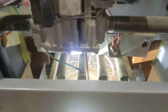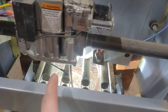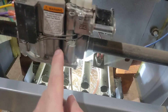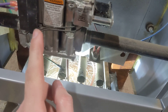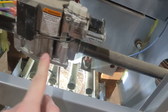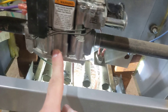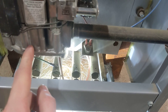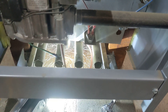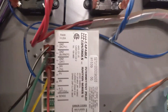What's been going on with this boiler is: the pilot flame will light, the burners will ignite, the gas valve will open, the burners ignite — and then immediately the gas valve gets shut off and the burners go out. Then the controller tries to relight the pilot as if it didn't exist, so you hear the sparking of the ignition. There's something going on where the controller thinks the pilot light went out.